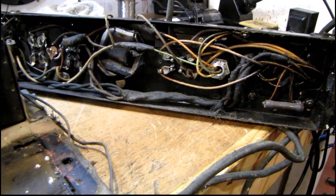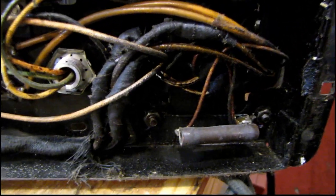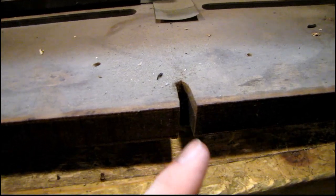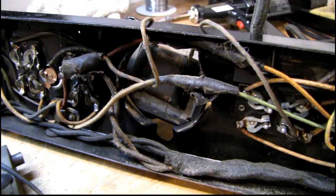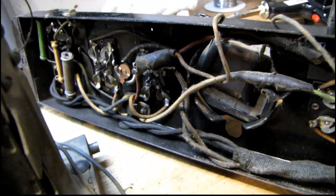I've got the power converter chassis out of this Spartan radio now, and I notice the power transformer looks like it's been replaced — apparently the old one melted down. There's a nasty sticky tarry substance on there, hopefully just tar and nothing toxic, because it's pretty nasty — just all over underneath the chassis and all these wires are spliced. That capacitor there is not original, and that choke coil mounted underneath the wood is not original either, because this cut here doesn't look factory — it's kind of rough. So I think what I'll do when I go through this chassis is mount that choke coil over top of that old capacitor hole and give it a clean up. Maybe put shrink tubing over where that tape is — I don't really care for electrical tape. That's an old repair though because that's old cloth tape.